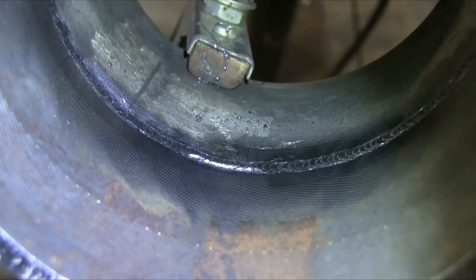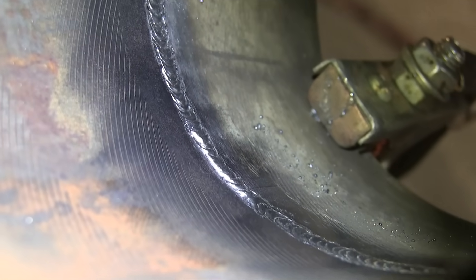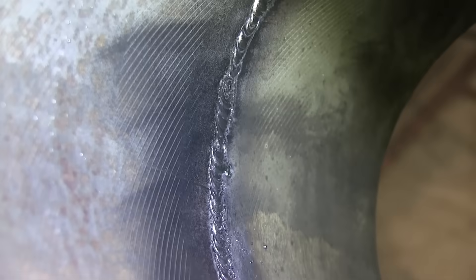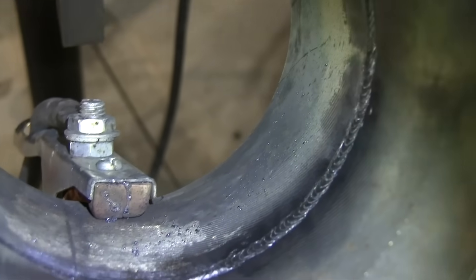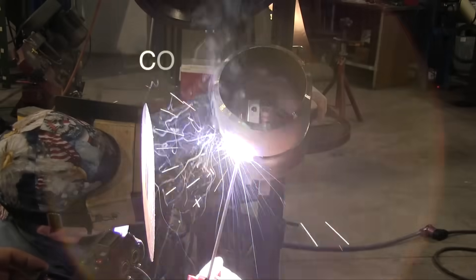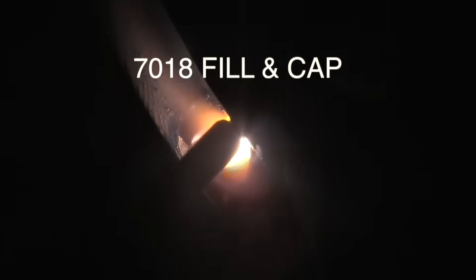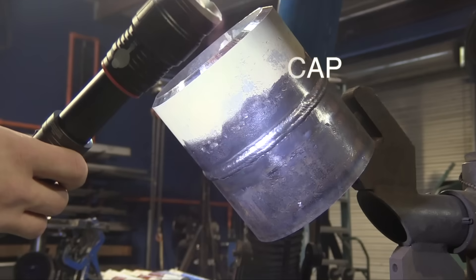Let's take a look at it after a wire wheel on the inside. This is the bottom at 6 o'clock — panning upwards uphill. There's the side tack at 3 o'clock, coming up to 12 o'clock on the other side. Even though this is poked through pretty good, after the hot pass and fill passes it'll often push through even further. Coming soon will be part two — filling and capping with 7018, a two-bead cap. But for this video I just wanted to focus on the root.